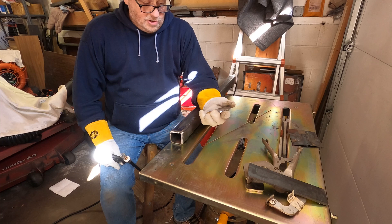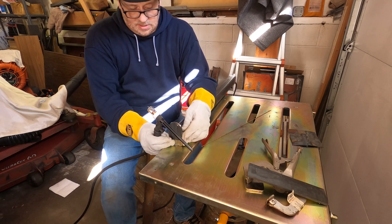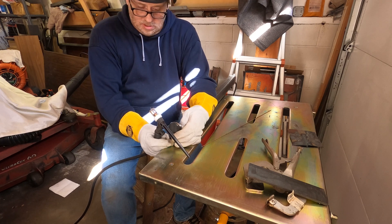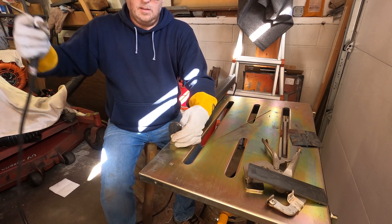All it's going to do is sit on here — there's no attachment point one way or another. It has two end caps that will keep the frame from going off either end. The idea is to set the car at one known point, which would be the rear leaf spring bolts, and everything else at that point is fluid. What I've already done is ground the edges clean and cleaned it up with some acetone. We're going to tack the end plates in place, weld all around, and this top cross piece will then be done.